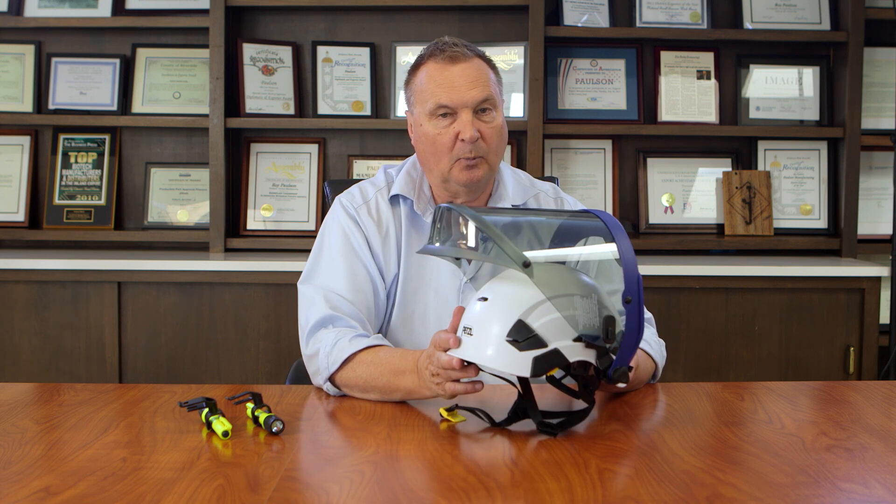This is an AMP-112 HTP — a 12 calorie nanoparticle face shield — shown in the stowed position and deployed position. It has a detent as it flips up, and is adjustable so that you can nod your head as a welder would do to drop the face shield, or you can have it tighter and just pull it down by hand.